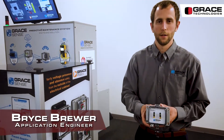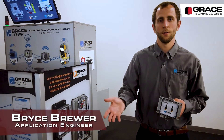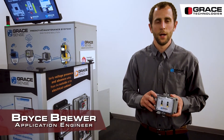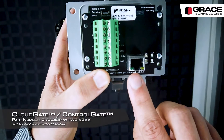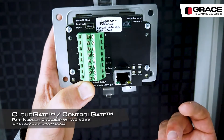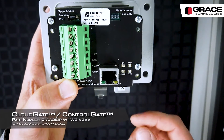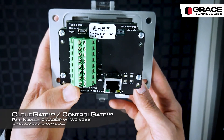Our cloud gate is the parent in the network, sitting within 30 meters of its children to receive the 802.15.4 communication. This unit is configured with Wi-Fi to bring data up to the cloud. We also offer LTE via AT&T or Verizon. On the back there is an RJ45 Ethernet port to communicate with a PLC, and that can be used simultaneously with the cloud connection so you can have data in multiple places. We currently support EtherNet/IP to ControlLogix or Modbus TCP/IP.